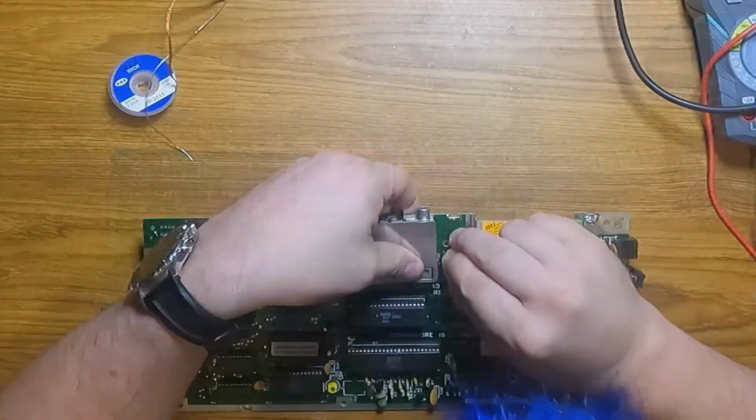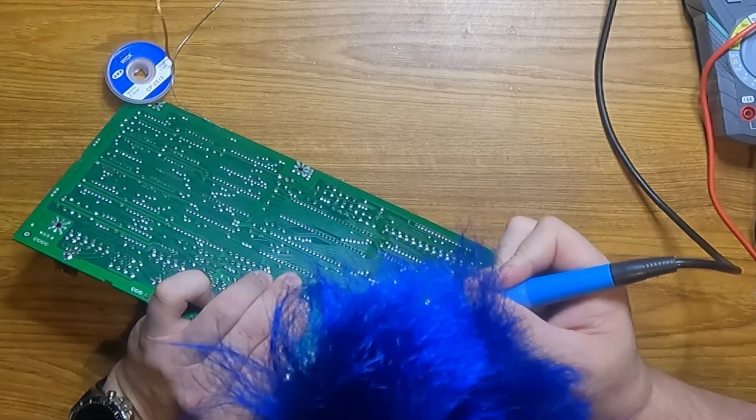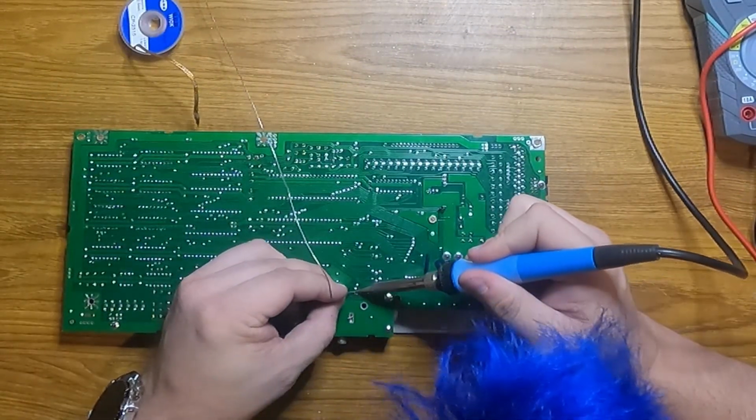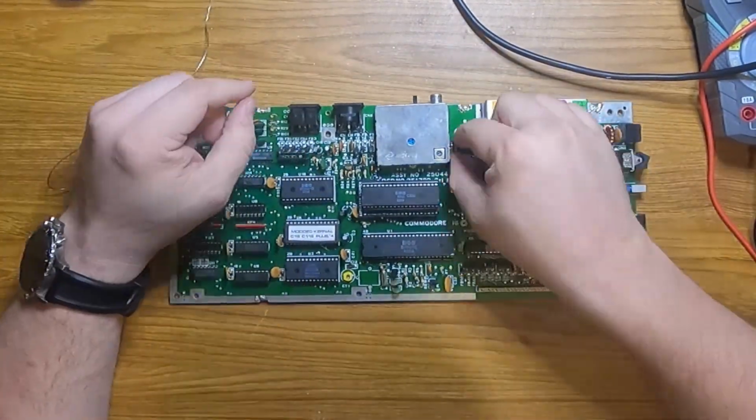The holes in the vias are the right size and space to put a 2-pin right angle header in here, and it's completely trivial. I don't think it matters which pin goes to which chip, since they're just address lines, and the RAM doesn't care which is which as long as it's consistent.